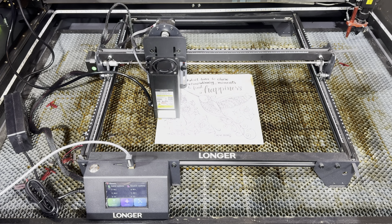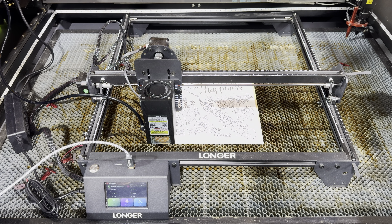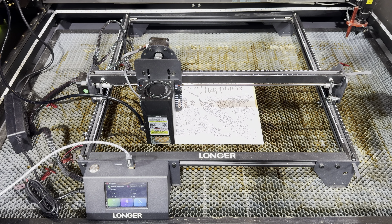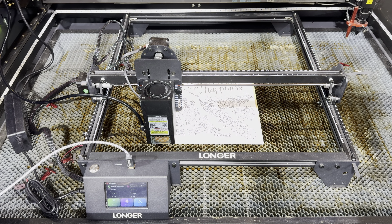So if you're happy with the way it framed, we are going to go ahead and cut this. The settings I've got this set up with are 100% power at 5 millimeters a second. Right before I did this, I went ahead and tested it on a scrap just to make sure it would cut through properly. If you're testing without a picture on something, you may need to account for a little bit more power or a little bit slower speed, depending on how much glue you've used. So I'm going to close the lid to my smoke enclosure, do the cut, and we will be right back.